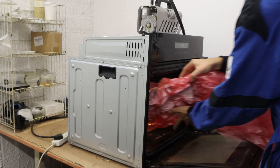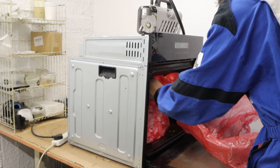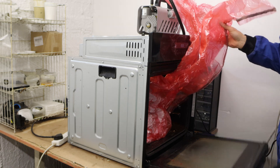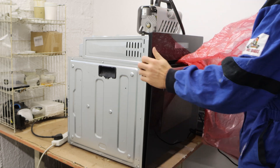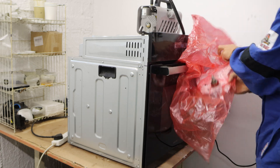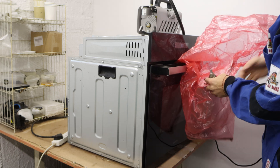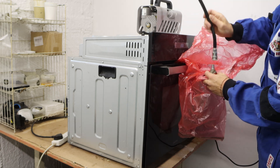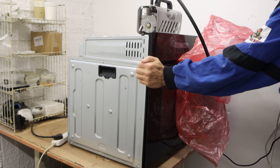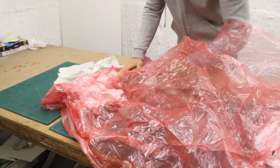I'm using my average small oven to cure the prepreg. I chose the smaller oven because it typically consumes less energy than my larger oven, making the work more cost effective for smaller batches or individual projects. The curing temperature started at 60 degrees for 2 hours, then 70 degrees for 2 hours, and 120 degrees for 2 hours. At the end of the heat cycle, I switched off the oven and let the part cool down in the ambience.